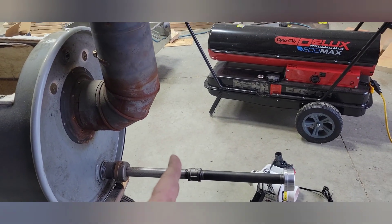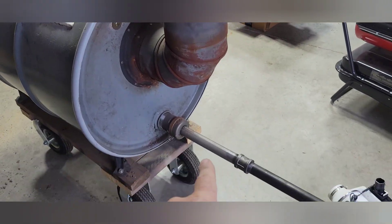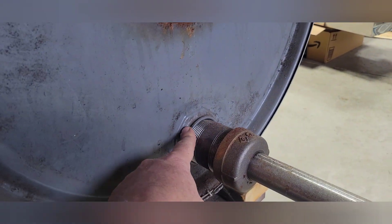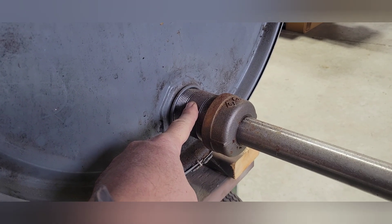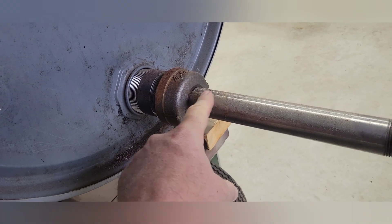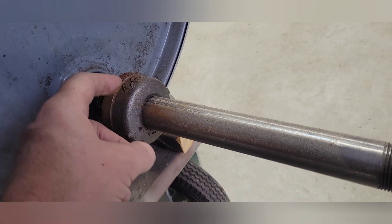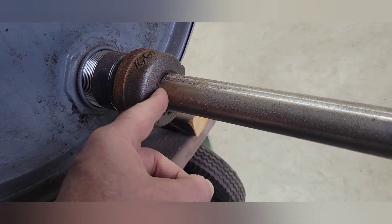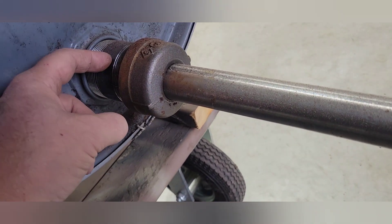I could probably go shorter with it, but I didn't want the radiant heat coming off of there and messing with my fan, so I made it a little bit extra long. Here's your standard two-inch bung — I just got a two-inch close nipple there with a cap, and I drilled a hole in the cap for clearance for the one-inch pipe to go through. Inside of that I have female threads for this pipe to screw into, and I press-fit it into the nipple.